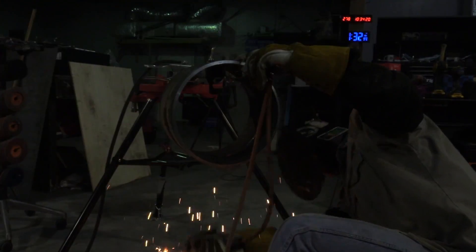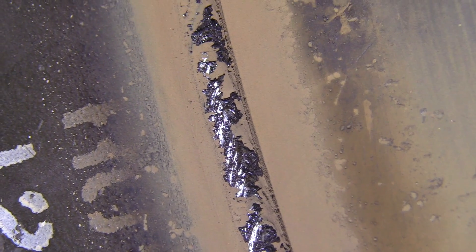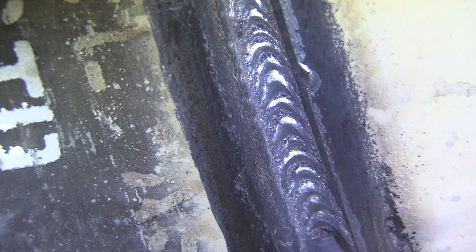He's got that requirement of a 1/16th max on the cover pass. So that's the hot pass. We'll wire-wheel that all the way off, and then that's it — wire-wheeled. And now for the next pass, the fill pass after the hot pass.